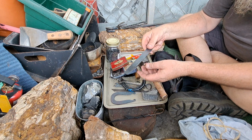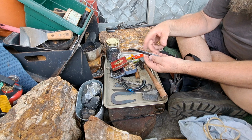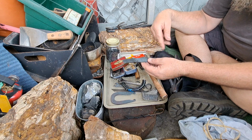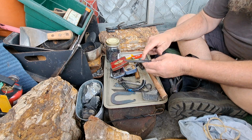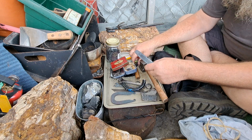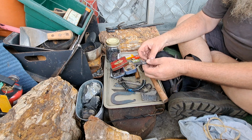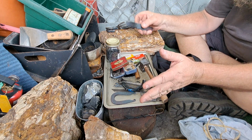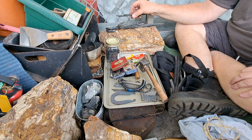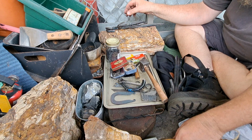But I've got to go, and I'm going to give it a brush over with the wire wheel, and then put it in the oven to temper it, because it's been hardened but hasn't been tempered. I've got to temper the little knife as well. Those two are going in the oven now. And clear coat these, and then that's all. As I said, got plenty done. Very happy with today. Very, very happy.